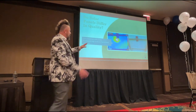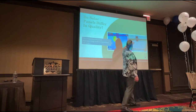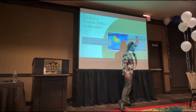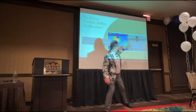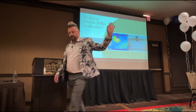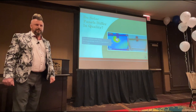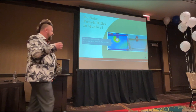So we had our overheating cracked back sheet here. We've got two bubbles going on, but this one is creating this hot spot just below our junction box. So this black thing, another key glossary term, is your junction box. You've got an overheating cell there. Because I can see visually that this is bubbling, what have I got to tell my customer? You've got a potential fire risk, so you've got to replace your module. More revenue again. Knowing what to look for brings more revenue.